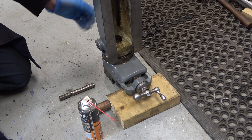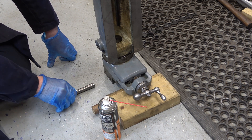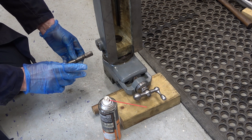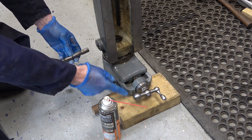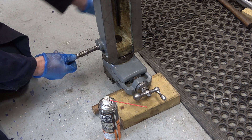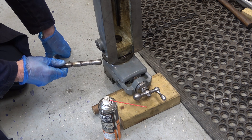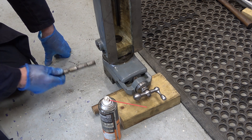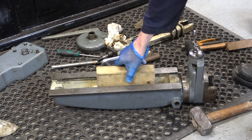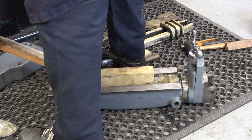This has been standing on end all night soaked with penetrating oil. I checked that YouTube channel and it was Paul the Shed Dweller, disassembling an Alba shaper. I realised that this vertical slide needs to be pointing down, and then this pin has to come out. Last evening I was really having to smack this pin to get it out — I was still concerned I was going to break something — but that's how it comes apart. With the pin out, I should be able to knock this off now.